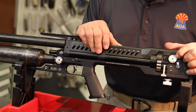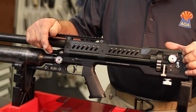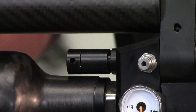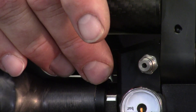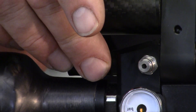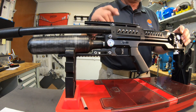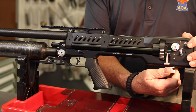This is the regulated pressure in the rear. The regulator is here where my finger is. It is not recommended that you change the regulator in this gun — it is honestly optimized for the length of barrel. If you increase the pressure, you're going to lose nothing but shot count. It's set at 140 bar.